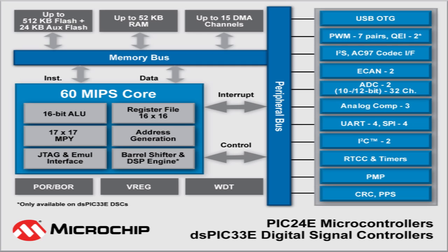They have a few new capabilities for our 16-bit portfolio at 60 MIPS. They also come in larger packages — 144-pin packages — to give you a lot more IO, a lot more control, a lot more peripherals. They have up to 32 ADC channels, 14 PWMs, two CAN modules for communications, and also an integrated USB-on-the-go host and device. And that 144-pin package is a first for Microchip.